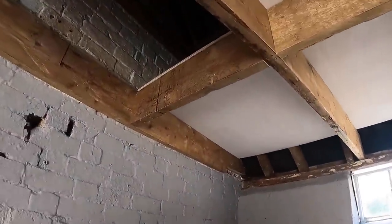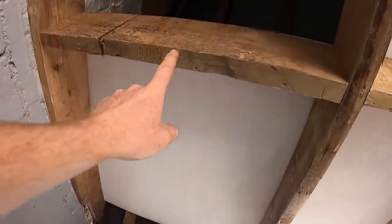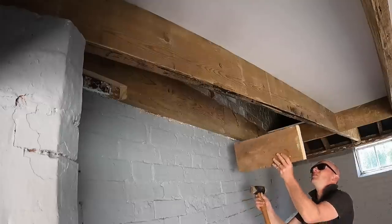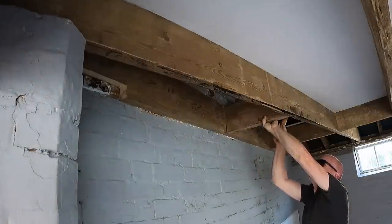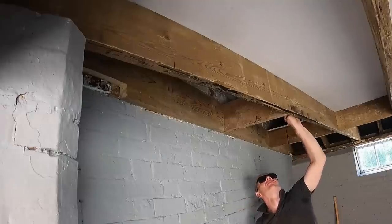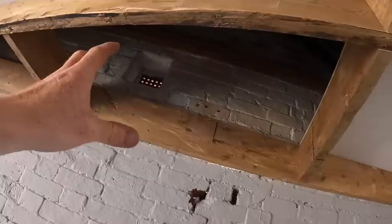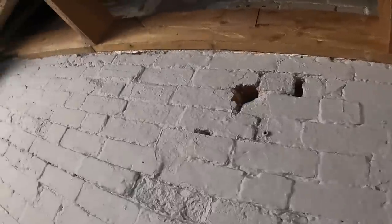Quick change of camera - that one is in now, mitered in there. I'm probably going to take a few mil off this board just as a little waney edge on that corner, and I want the loft hatch to sit on something nicely. I could do carpentry like this all day long - bit rustic but structural and strong. Fit for kitchens and bathrooms. So there is our opening - I think that's a good size. By the time the ladder's on there you still get something fairly sizable up through there.